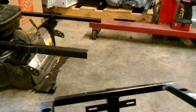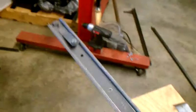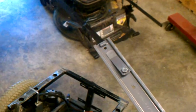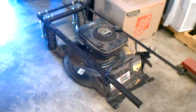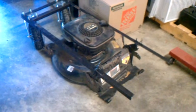I just want to make it where it'll come apart. I might end up welding it together just because this stuff is so ridiculously hard to drill through. I found some good stuff that's not going to be ridiculously hard to drill through — this stuff here, it came off some kind of server, whatever — it's a slide-out rack. This seems to be regular steel, sturdy enough yet flexible enough that it'll be fine to suspend the deck. So I'm going to start with this; if I need to, I'll beef it up or even double it up. Because I was originally going to do another piece of angle from the bed frame, but since that stuff is so hard to drill through and I don't have a cutting torch, I'm going to roll with this.